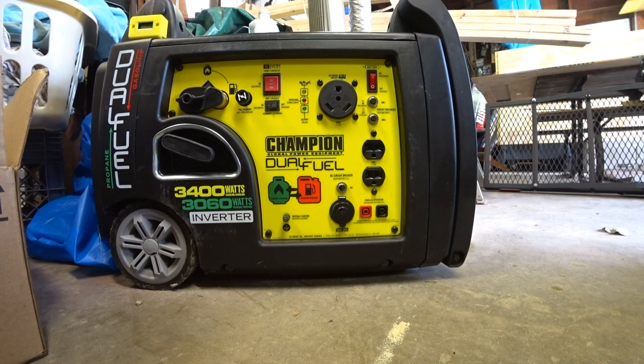The whole idea of running smaller generators on propane at higher altitudes and trying to power a rooftop air conditioner is not going to work - it'll overload. That's why Mike and Lynn have that other generator, the little blue one. You could convert that to propane too. I don't know how much of a drop it has at elevation, but it must not be significant enough to cause problems or Micro Air wouldn't be recommending it. They sell to the entire country including people in the hills, so if they say it'll run it, go for it.